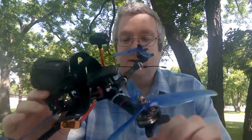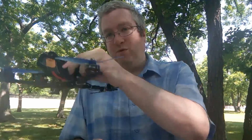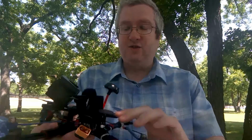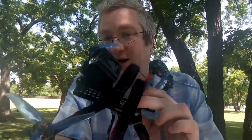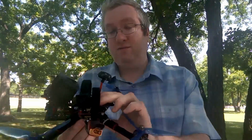Except that Kakute, something was wrong with it. First day I was out, I bumped into the grass, just a little boop, and the drone fell out of the sky. The VTX OSD stopped updating. I couldn't arm, disarm, anything. I had to pull the battery. And over time that was getting worse, and it got to the point where just doing a snap flip or a roll, the quadcopter would lock up, the flight controller would freeze. I swapped it out for a Helio Spring that's in there now. That's the Butterflight flight controller with the F3 and F4 chip, and it's flying perfect again. So, happy about that.